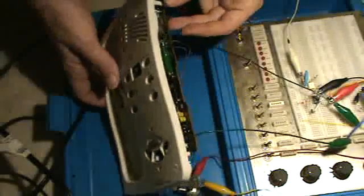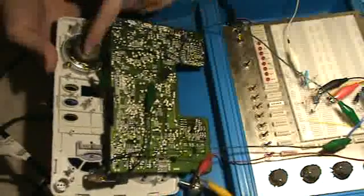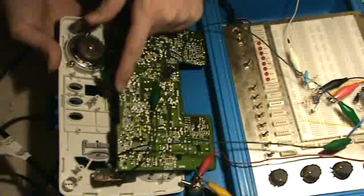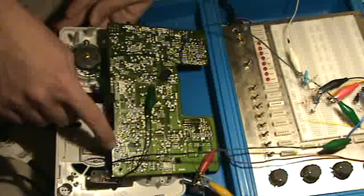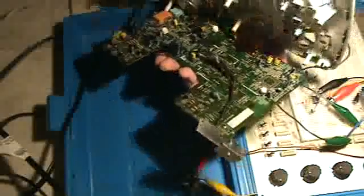What I did to get this little amplifier out of this phone was I went to the speaker, which is right here. I followed the wires from the speaker back to the circuit board, and from there I followed the traces on the circuit board. This is a double-sided board, so they go through to the other side too. I kept going and eventually ended up at this little chip right here.